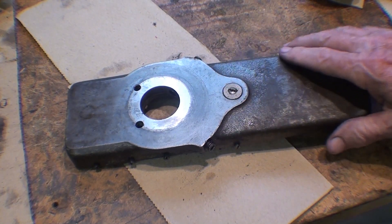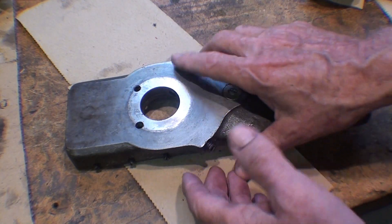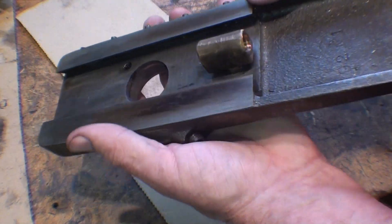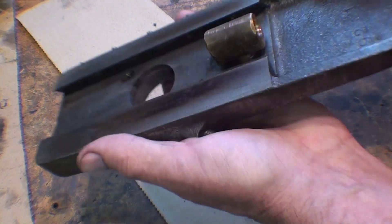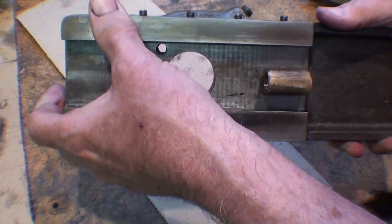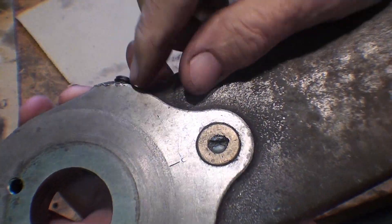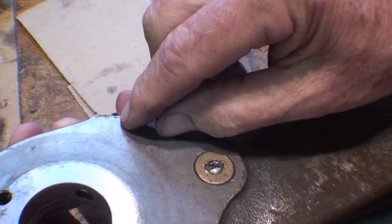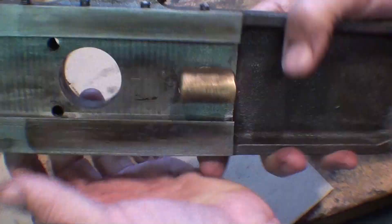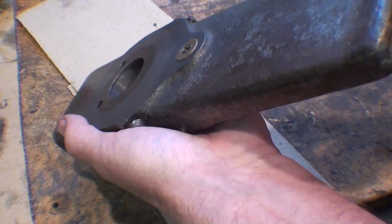I've been working for about a half hour. My hand stayed semi-clean until that one glove disintegrated. The cross slide looks pretty good. I'm sure the brass nut is worn — I didn't take that off. I'm not going to do anything to this except I've got quite a burr right here where somebody rammed something up against this wall. I'll dress that with a file. That's clean and dry and ready to use.